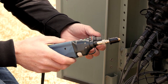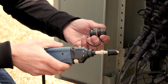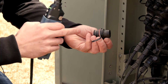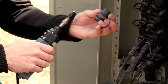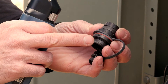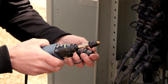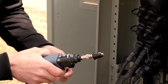The next thing we're going to do is the actual inspection of the connector at the drop terminal to make sure it's in good shape. One important thing to understand is that there's a key on these connectors. This assembly in my hand is the same as what we have in the drop terminal — I'm just using this piece here for a better view. There's a key here, and that key has to be aligned with a dot on the tip. Aligning this dot with the key ensures that the angle of the connector corresponds to the angle of the lenses inside the probe. These are APC connectors, so it's very important to take care of this.